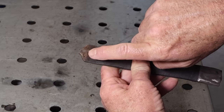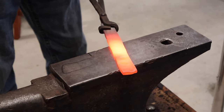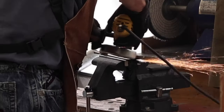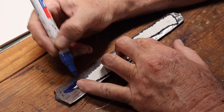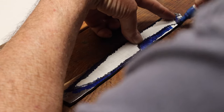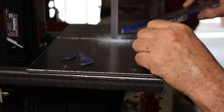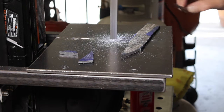You can see here some of the weld from the handle — you can see the different color of that weld on the handle. I went ahead and drew it out a little bit more and tried to get it all straightened up. Once I had the right length, I ground the forge scale off and marked my pattern out so I could cut the blank for the knife. Most of it I cut out on the little portable bandsaw that I built, then took it over to the angle grinder, cleaned up the edges, and got most of the profiling done.